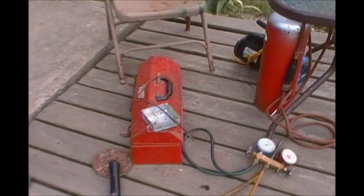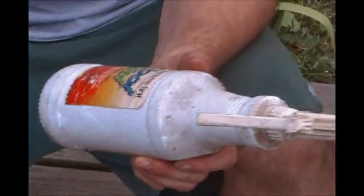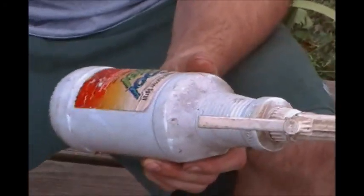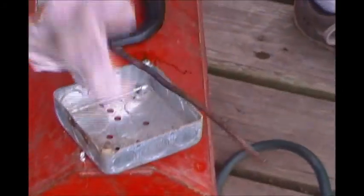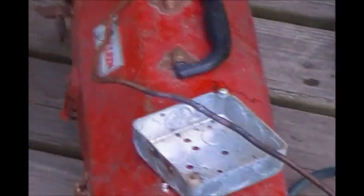I'm going to get a rag. Because we're not hooking this up to a unit we're not worried about moisture, so I'll go ahead and throw a wet rag on it. If you're working next to a valve on a condenser or compressor and need to do some brazing, they have this cool gel which you put around the valve or the valve stem, because you don't want to overheat that valve — you'll cause an issue. You can either use that gel or just take a wet rag and wrap the valve so you don't damage it. Also, remove your Schrader valves before you start doing your brazing.